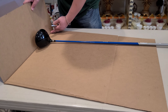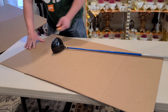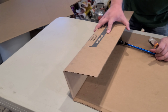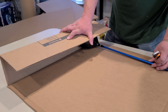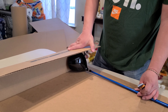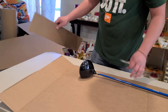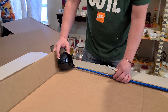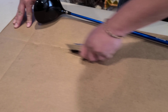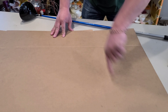We'll use this and go ahead — we got to mark it here so we have enough room at the top for the club head. So we go here, and the club will be positioned that way. What we're gonna do is make a triangle rather than a square — we can make a square too but the triangle is quicker. We'll mark here and we're gonna go with the grain, because it's a lot easier when you go with the grain. This direction crosses the grain, this crosses the grain — we'll go with the grain.